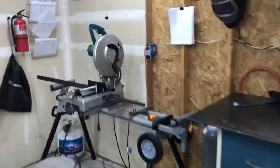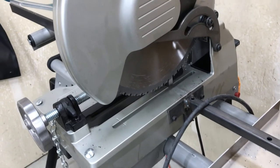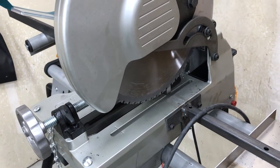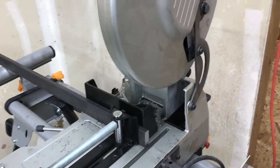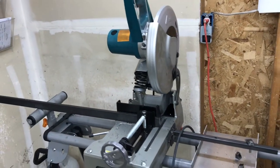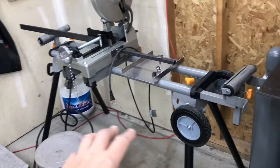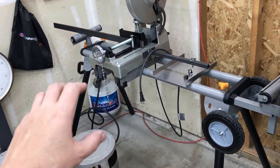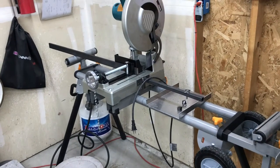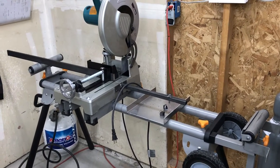The next thing I did was this cold cut saw. This isn't the same as a disc saw — I used to have one of those for cutting steel and I gave it away, actually gave it to Mike. Didn't enjoy that at all. This thing is awesome though for making pannier frames; this is definitely the way to do it. I like the working height — it's better than what I was doing with the bandsaw, where I was always hunched over and the cuts were a lot slower.